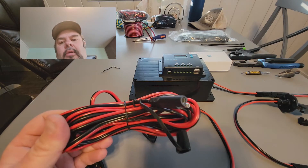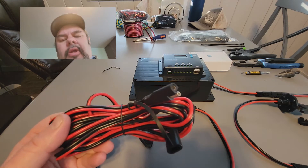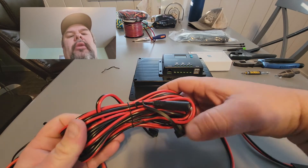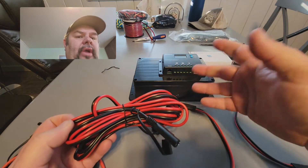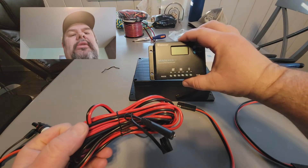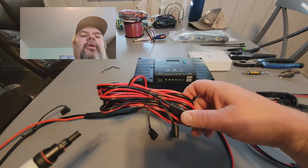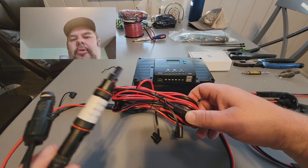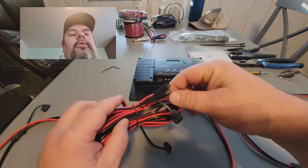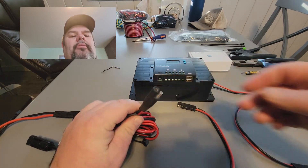This is size 14 wire or size 12 — a 14 will handle 15 amps and a 12 will handle 20 amps. We're only going to run 5.25 amps if we wire two 100 watt panels in series utilizing this controller. Just worry about plugging one panel in for now; you don't need to worry about series/parallel rules. Essentially, the red will plug into the red of the panel and the black will plug into the black, so you've got the right polarities.